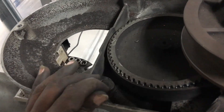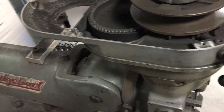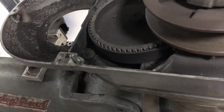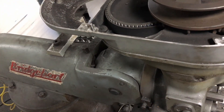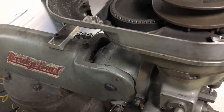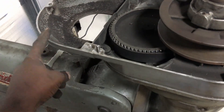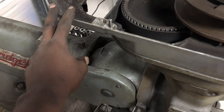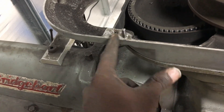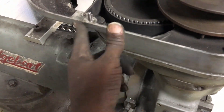There's a pin here, and there might be one other pin in the other piece. So this is pinned. If you take off the four allen key bolts, you might still get some resistance — so a rubber mallet is your friend. And if you're going to pry, be careful: this whole thing is aluminum and it's very easy to damage this piece, especially with this overhang creating a lever arm. I suspect you'll end up cracking here if you try to pry too hard, especially since the pin is here. I was very careful and it took me a little while to get it off without causing too much collateral damage.